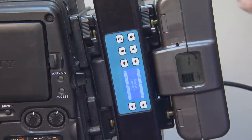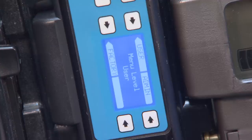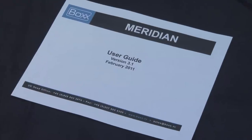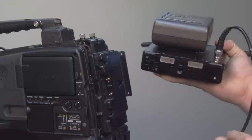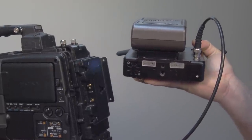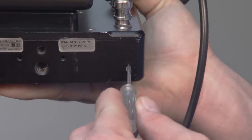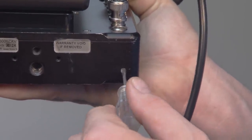Pressing the down key again takes you to the menu level page showing the menu level user. Other menu levels include admin and factory. For these advanced settings, refer to your user guide. At the bottom of the transmitter, there is a small white pot that can be adjusted to control the internal fan speed. It should be kept at 100% if at all possible, unless sound becomes an issue. Please remember to turn it back up at the end of any sound issues.